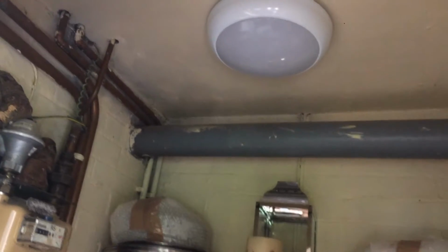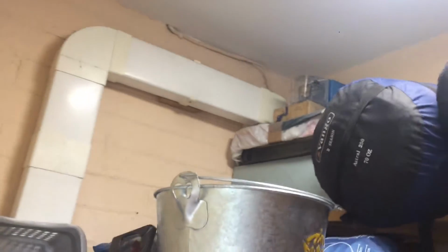Sleeving was missing in the fitting, and there was one there thankfully, but it wasn't there. And then this one was even worse, because we've got the extractor fan running off the light, this is how it was wired originally. This is a setup as it was before I got my grubby little hands on it, but there was a 2.5mm cable going to that extractor fan, and they weren't long enough. I had about that much extra play, and it didn't give me much to connect into. So I had to join them all, and yeah, that was fun.